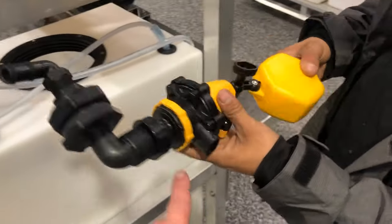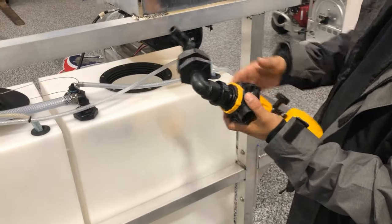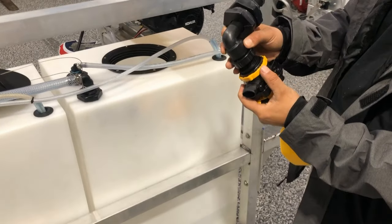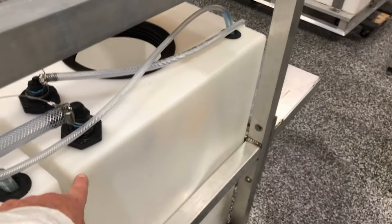The other nice thing about the Topaz over the Hudson is these will actually fill a lot faster — you're getting more water through it. That's how we set up the float valve. If it's going to the side of the tank, you're not going to use that slip 90.